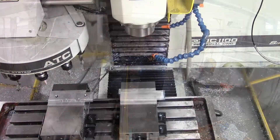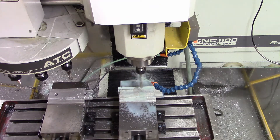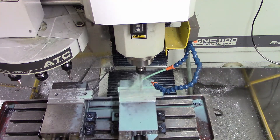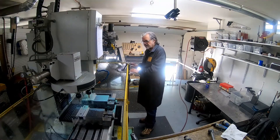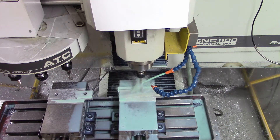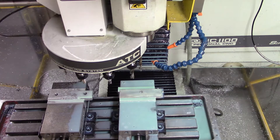Let's go through the standard preliminary examination when a program is being run for the first time after not being run — because memory can be faulty. Single block, verify pre-feed is reasonable. The toolpath program puts in a rapid to about an inch above the surface, and when I'm single stepping I can stop it there and verify. I've got my finger on the stop button. On to the feed Z height — yes, that looks correct. I believe I'm going to have success drilling with a fast peck to try to keep the chips under control.